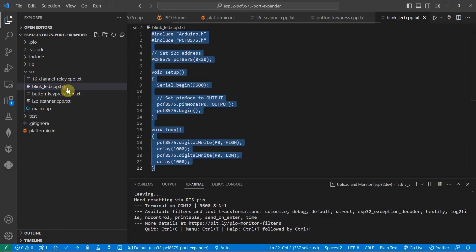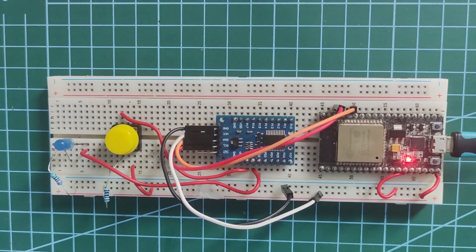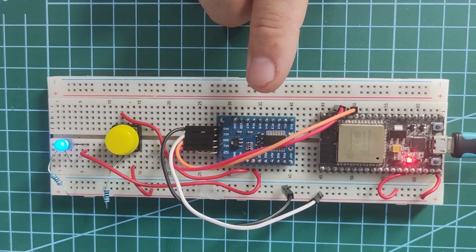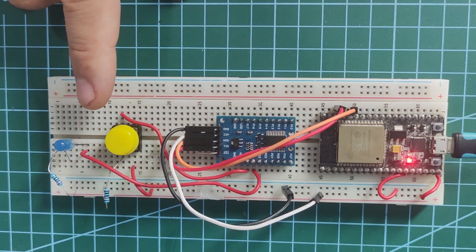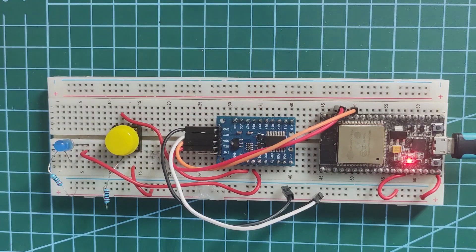The other thing is regarding the Blink LED, and it's really simple. It's just the same pattern. This is the Blink LED pattern. You just need to set the output. Once the output is set, then by running this loop action, you would turn on or turn off the LED. I have here my ESP32 and my PCF8575 IO Expander, including the LED and a button switch. As you can see, the LED is being driven by the PCF8575 IO Expander.